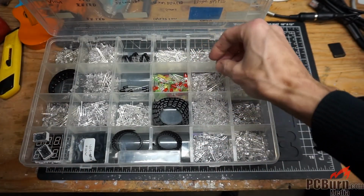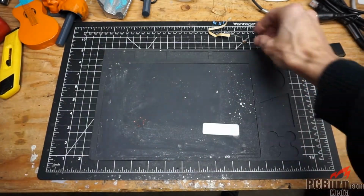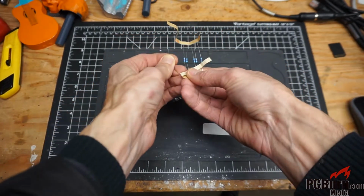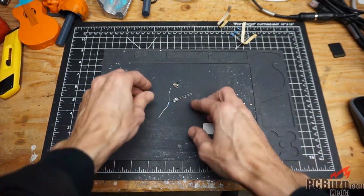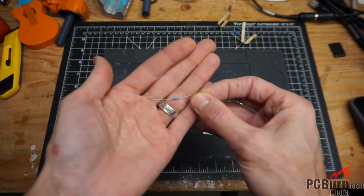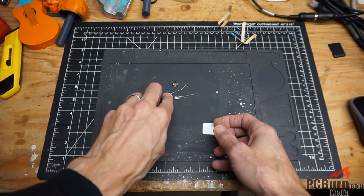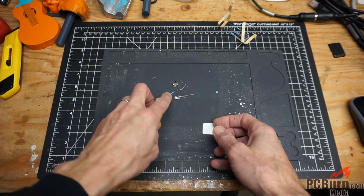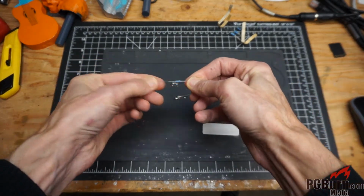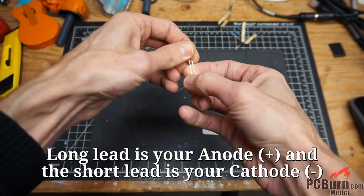And for this case, I think I'll be pulling out a flickering red LED because it's more candle-like. And one 22 ohm resistor to put in line. And I'll just use the leads from the 22 ohm resistor for our wiring because, just in case you're unfamiliar with what a resistor looks like, that's a quarter-watt resistor. Should be sufficient for our needs. The wattage on it is the amount of heat it's able to dissipate. Well, relative anyway. The amount of power it's able to dissipate safely, but it dissipates it as heat. So, and let's see. There's the long and the short.